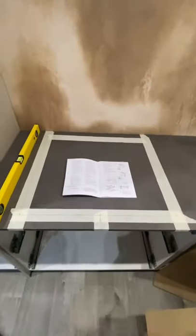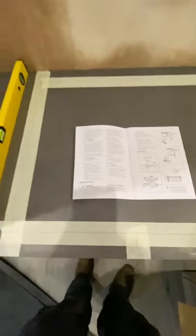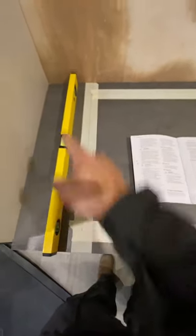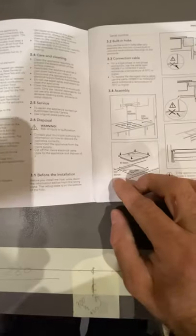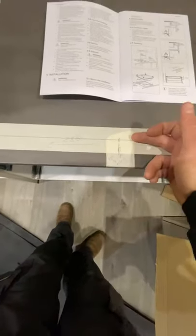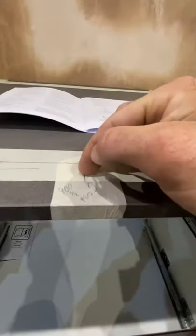So the next section of this video you'll see is this bolted together and we'll start getting the splashback on. Before we connect this worktop up, I'm just going to run through how to mark out the hob cutting. So we've got a 900 unit — half of 900 is 450, so we mark the 450 centre line. We go to our instructions and we've got 560, so half of 560 is 280. 280 from your centre line out each way. What we tend to do is go off a good machined edge or straight edge, measuring front and back, so you know these measurements are going to be square. Come back to the instructions — 490 from this cut at the front to the back. It does show you have to have a minimum of 55mm from the back of the worktop. We've got 60mm here, achieved by measuring from the front of the worktop to the carcass and then an extra 10mm. So our cut will come 10mm into this rail so it'll be hidden behind that rail there.